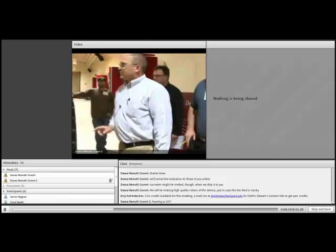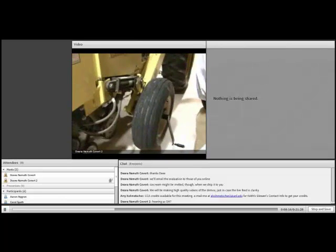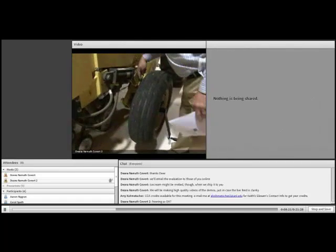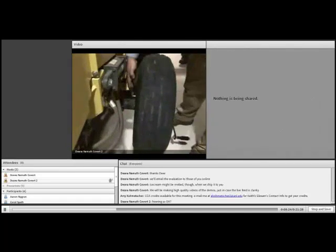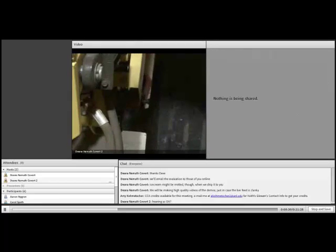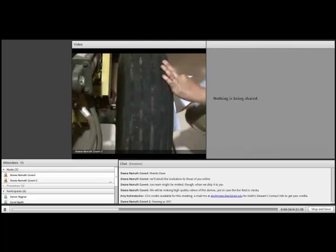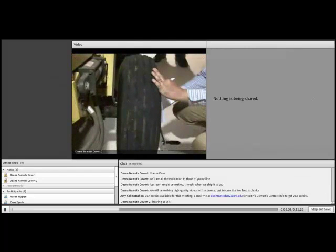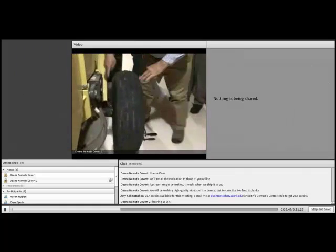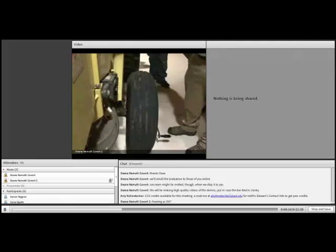The other thing you'll notice on this side of the drill is the drive wheel, and there are two different mechanisms that cause this drive wheel to engage. One, if you look right behind here, there is a pin that meets a welded shaft on the drive shaft itself that locks in place. As you pull this out, it disengages the drive wheel, in theory. Now you can see that it's disengaged, and when that drive wheel turns, it won't spin any of the mechanisms to deliver seed.